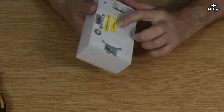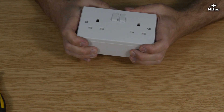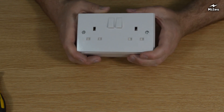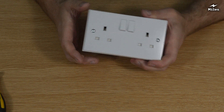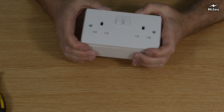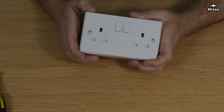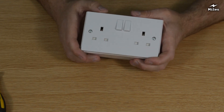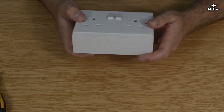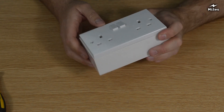The 40 watt-hour lithium-ion battery — that's not going to give you an awful lot of power. But let's say you're running something that's 10 watts; obviously that will give you about 4 hours. Or 40 watts for 1 hour, that sort of thing. Like a camera battery charger — it's probably going to be about 5 or 6 watts, so you're going to get about 8 hours on a set of 3 batteries. And of course you could always bring another 3 batteries along with you and a small screwdriver, and then you can be off again.